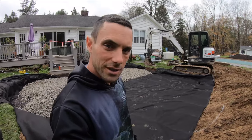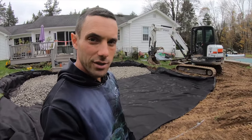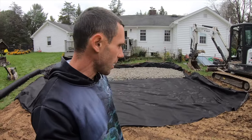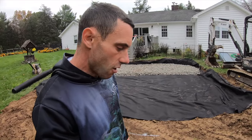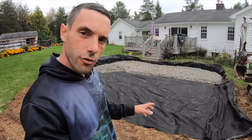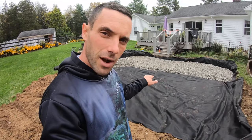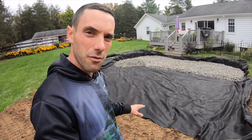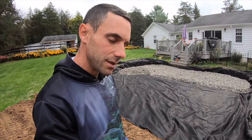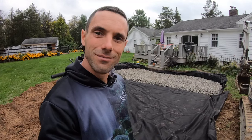These fabrics, you can typically buy them at hardscape and masonry supply stores, drainage supply stores, at least good ones. The rolls vary by size, but we're buying rolls that are 400 or 500 feet long, and they tend to run about $1 a foot, give or take. So our crew's going to continue installing this clean gravel bedding layer until we complete the patio. We're going to compact it, make sure the elevations are where they need to be, and then we'll install our 3/4 inch base material.